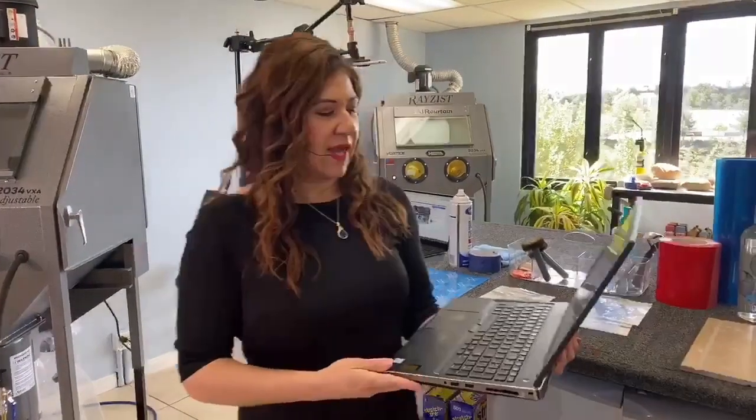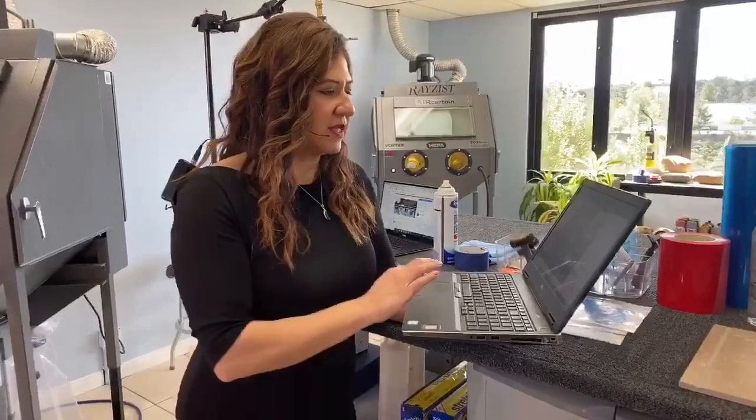You can use your laser. The laser's going to etch your glass. It's going to engrave it. But what sand carving does is it removes that glass material, where you can feel that depth. And it's just a higher perceived value. That's what comes with sandblasting. We're saying utilize your laser, then put it in the sandblaster and do a few passes and you have that depth. And that's why a laser engraver would add sand carving to the business for that depth.